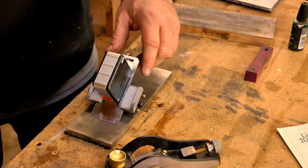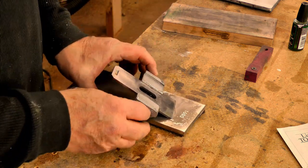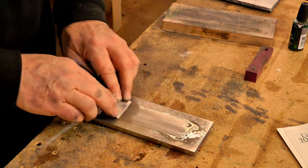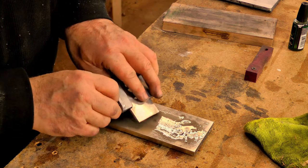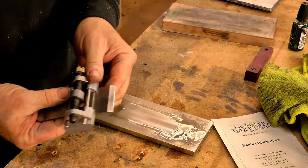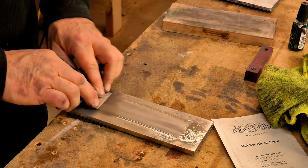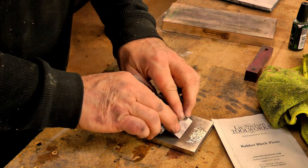It's going to be more like a 33 degree angle — I can't get it to go further up in there. I'd like to put a 40 degree angle on it, but that's all right. I'm going to do this maybe about 10 times using a 1000 grit stone. I'll hit it a few more times. Now I'm going to drag it back so I can create a burr on the other side to get a nice sharp edge. This really doesn't take too long, and once this is done all I'll have to do is polish it.